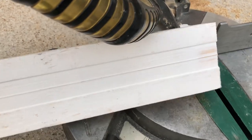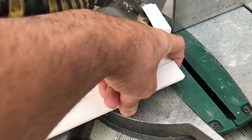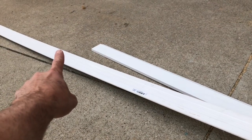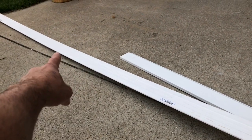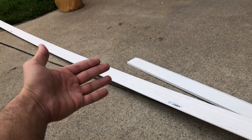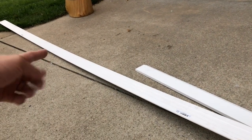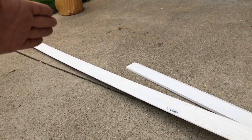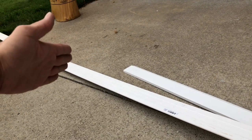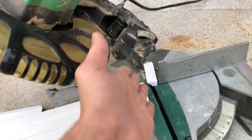So a lot of people will cut it backwards, because as long as you know that a 45 is gonna go into a corner, you would measure the distance from the wall to that. If it was 84.5, I would mark the 84.5 minus the 1 millimeter and cut a 45 inwards. Okay, so you're really gonna have to have that common sense to know that when this part of the wall here meets with this other piece, you're gonna have a 45 on both of them, and it's not a door jamb where it's gonna be flat, or sometimes if a wall is a 30 or something, you're gonna have to put it at the 30. That's why you're gonna need this chop saw that can angle at what you wanna cut it at.